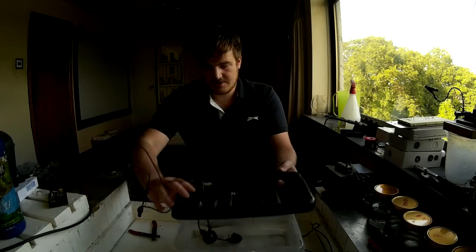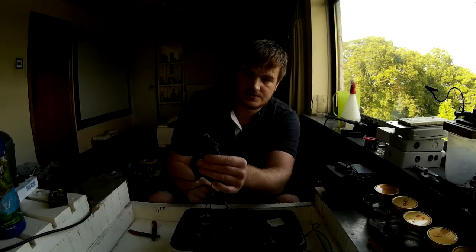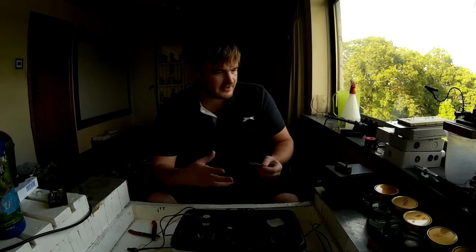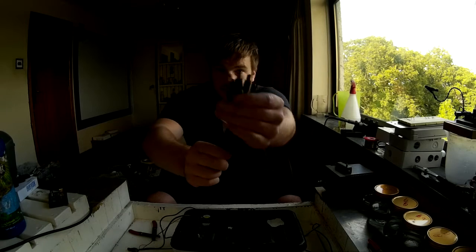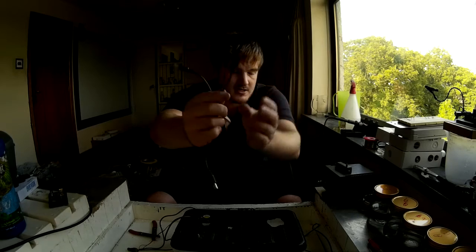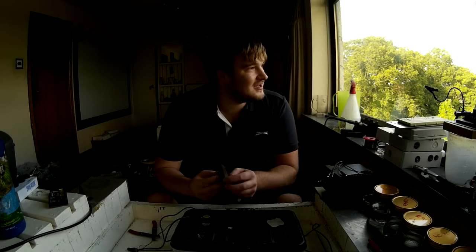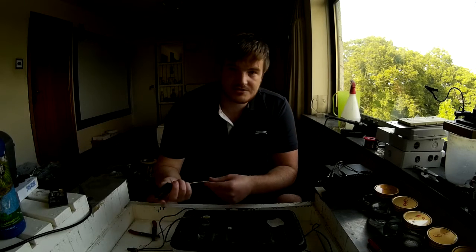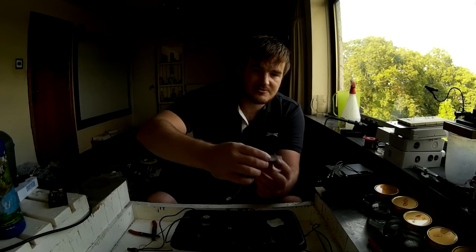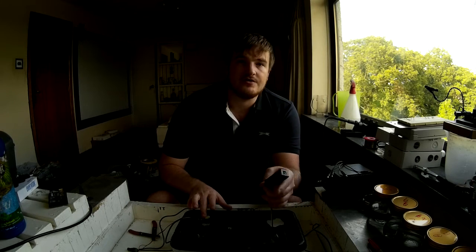Now, because everything's 24 volts, we can just link them all directly up to a 24 volt charger. But what I do recommend doing is buying one of these adapters, which changes the female end of one of these into 4, so you can run your fan and 3 ultrasonic misters. And also, if you're using it for a Halloween project, you want to control how much mist there is, I advise you to get one of these cheap fan controllers, which is just a voltage divider inside. So as I was changing the speed with my finger then, you can do it with this instead.